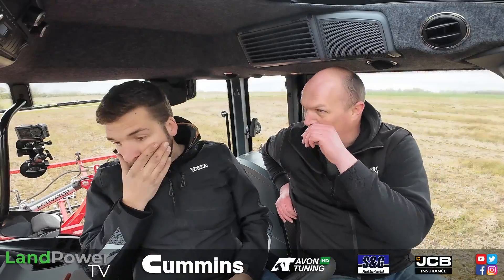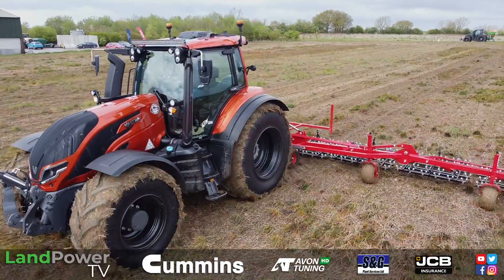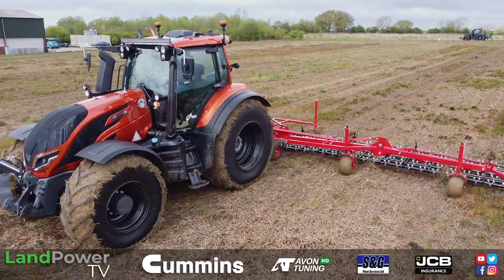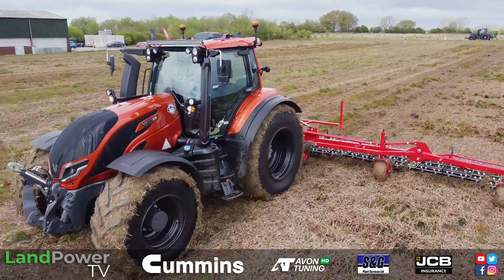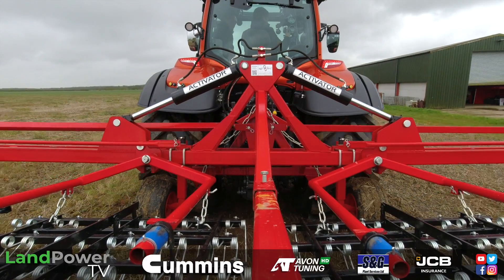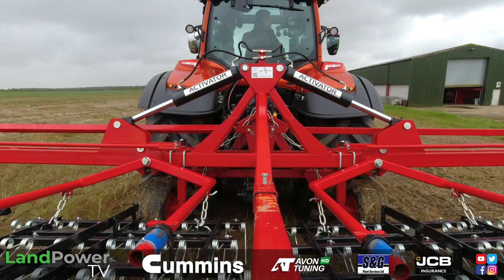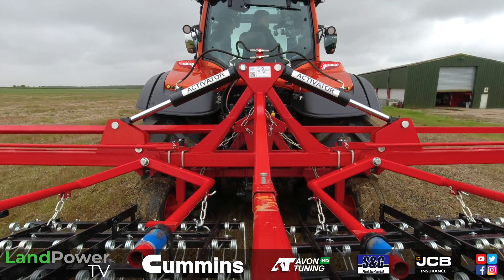So what's actually involved to kick off? All you need is guidance on your tractor to know where the tractor is in relation to your field or headland. What we need to do first is record a field boundary — I'm showing you this as if you're fresh to it. Would you have to set up a new job? All you need to do is have the width of the implement entered. So I'll show you through that. We've got a 12-metre grass harrow on here.